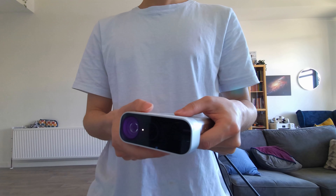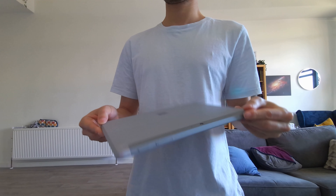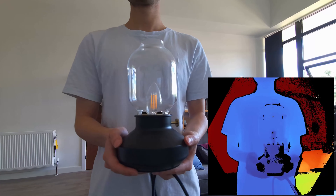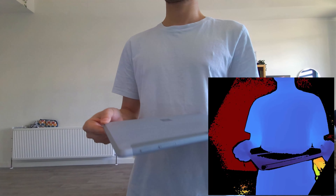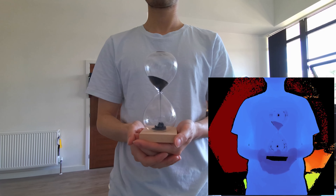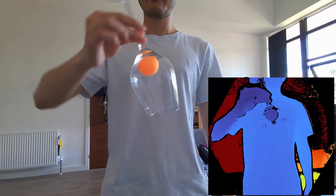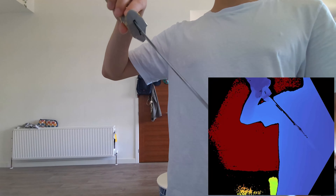This is the reason why the Kinect sensor fails in particular situations. With that active illumination picture in mind, let's go through all the cases where this sensor might fail. First up, we have scenarios where we are looking at a subject with either high transmissivity or high reflectivity — things like glass, water, or even clear plastic. These sometimes won't be picked up by the depth sensor itself because the infrared just travels straight through the material. Similarly, for objects with high reflectivity such as mirrors and polished surfaces, the light tends to bounce around in unexpected ways and interfere with the results.